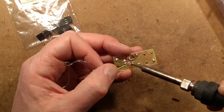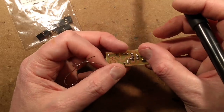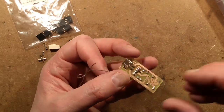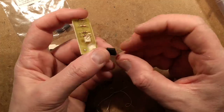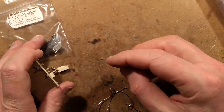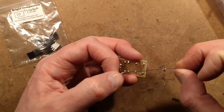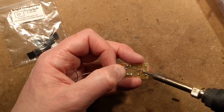The solder is flowing onto the other pads at the side — doesn't really matter, those are just options. For the PIR detector connector I'm going to use a three-pin connector — the generic type that's very common on eBay. This one came from Bright Components, a UK seller. It's based on the Dupont style connector that's very popular with Arduino stuff — it's quite a nice little connector. I'll solder the middle pin first and then make sure it's standing square.